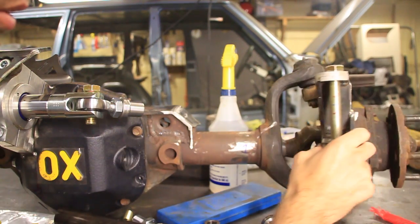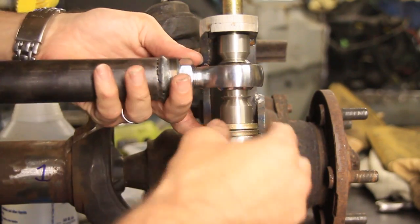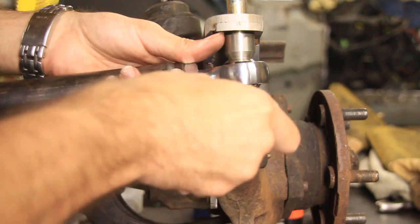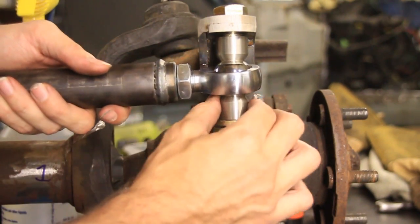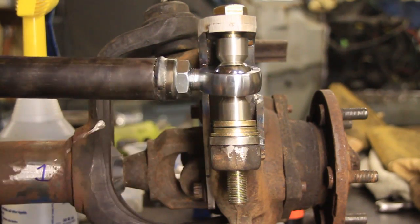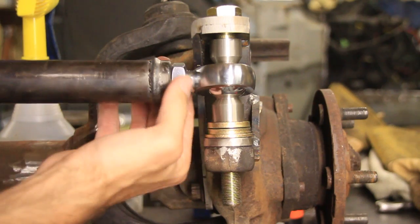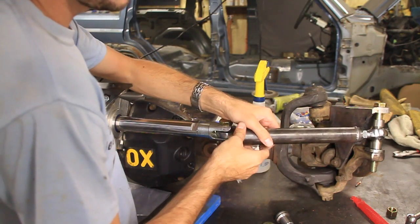When it's high, when it's low, when it's in the middle, it'll be perfectly lined up with this side. I figured this needs to be all the way up. For right now, I'm just going to add some washers onto the bottom — later on I'll probably make a little spacer to get that exact. I need to kind of get this in the middle; I want to back it off a little bit so you have room to go in or out. If you turn this, it'll adjust your toe in and out on your tires. You want to put it in the middle so that you can go either direction — in or out. Now I need to determine the length that I'm going to make these things.